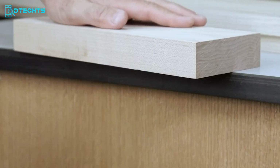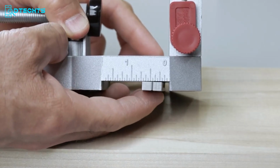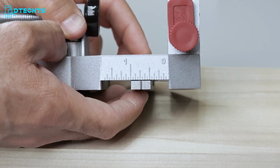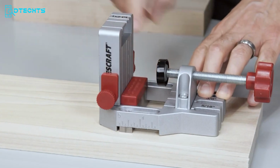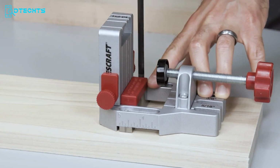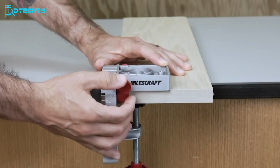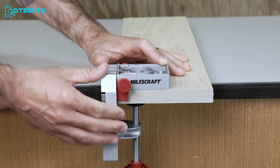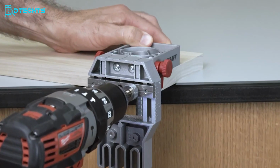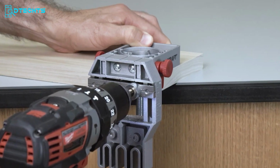These drill blocks are adjustable for boards ranging from 1/2 inch to 3 inch thick. Plus, built-in scales and centering marks guide the user to position dowel holes accurately. To make things even easier, the jig includes spacer blocks that automatically center the drill blocks on standard board thicknesses. The edge stops help ensure proper alignment of both boards, reducing the chance of errors. The built-in non-slip pad keeps the workpiece steady while drilling, protecting the surface from damage.